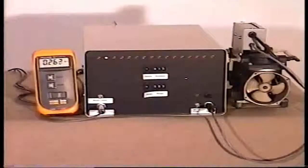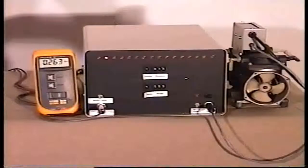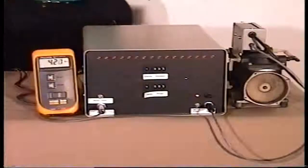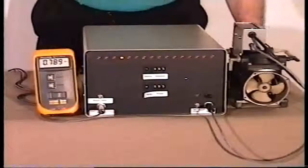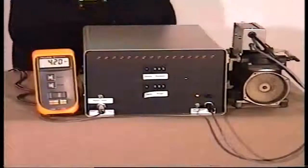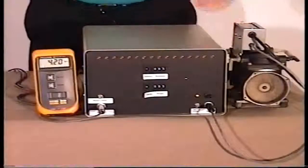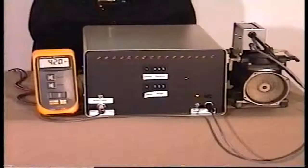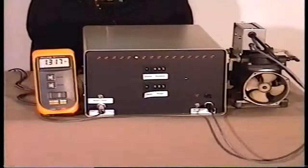In the interest of time, I think we're going to take it out of 15 seconds for the valves. I just switched it over to a 5-second valve cycle. As you can see from our indication on these LEDs, we're cycling right through the valves, and also on the voltage. As we go up through the valves, each valve puts out a different voltage. The voltage will increase roughly a quarter of a volt between each individual valve. As you can see, it's stepping up through here.